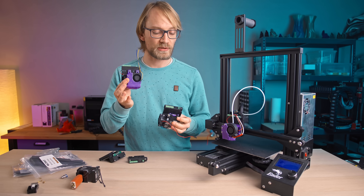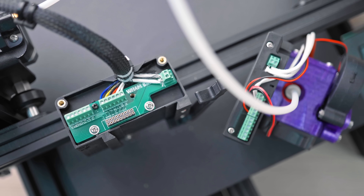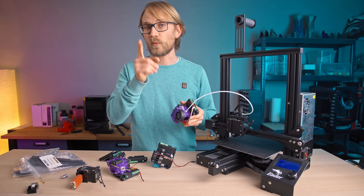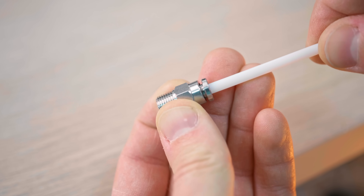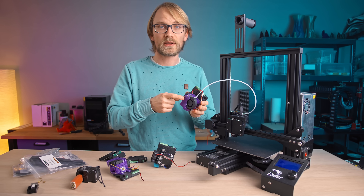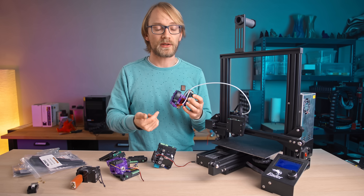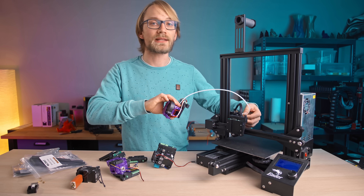The Mutant system is built for both Bowden and Direct Drive setups. You can get plenty of electrical connections to run a hotend, a bed sensor, an extruder, and a pair of fans from it. But with Bowden setups, your hotend is still going to be attached to the printer through the Bowden tube, which is why they are also including one of these Bowden connectors that's supposed to release more easily than the standard brass connectors and shouldn't chew up the Bowden tube as much. It seems to work better than these cheap standard connectors, but honestly I would still rather unscrew the connector from the extruder and just keep the length of Bowden tube attached to the toolhead instead of re-clamping it into the connector every single time.